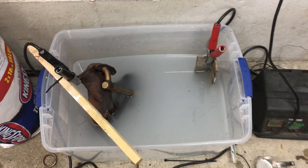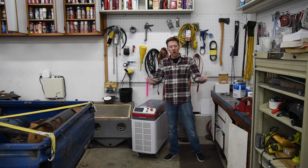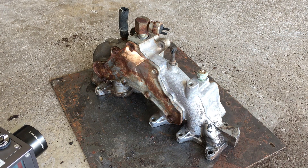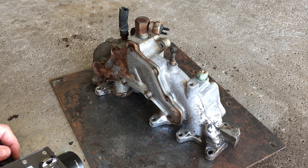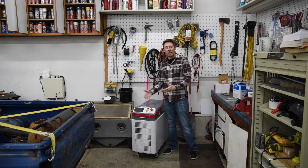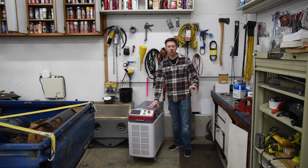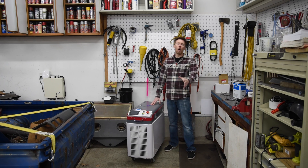Electrolysis works, but you're limited to the size of the container, and there is still a black residue where the rust was that still needs removed with a wire wheel or brush. Also, the parts have to be clean of grease or oils first, so there are still chemicals involved. Here is why laser cleaning is the future of rust and paint removal. There are absolutely no chemicals involved. The parts can be painted, rusty, covered in oil or grease, and it doesn't matter. There is no need to purchase any materials before each use, such as with dry ice or media blasting. These laser cleaning units come in a variety of sizes, ranging from backpack size to dishwasher size. This FLC200 by Fortune Laser is a little bit larger than a really large suitcase. There are two things needed in order to use these laser cleaners safely: proper safety glasses and proper ventilation.